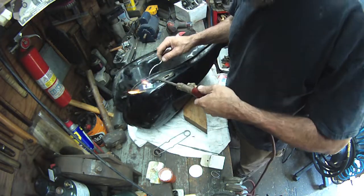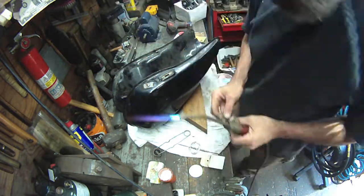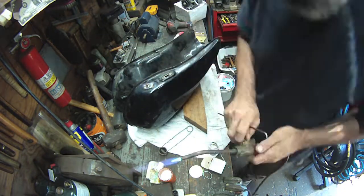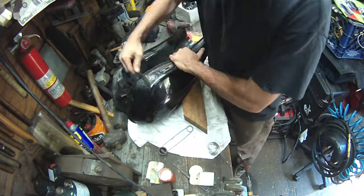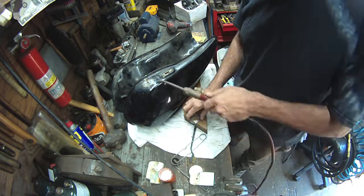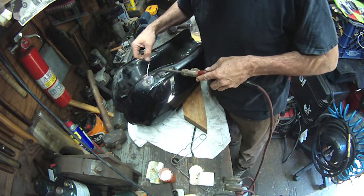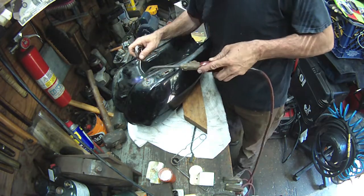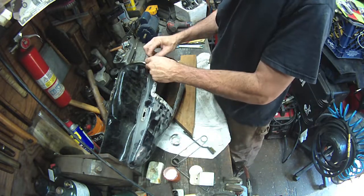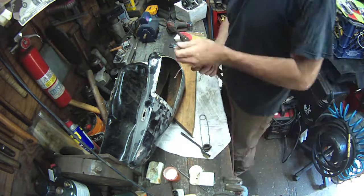It really doesn't take a lot of heat because it's a small quarter-inch barb fitting and it's thin sheet metal. I probably could have gotten away with using a propane torch, but the nice thing about this tiny little tip is that it's small and it focuses the heat right where I need it to be. The propane turbotorch tends to splatter the flame, and I just didn't want to create too much of an issue. This is funny because this is the bottom of the tank on a sawmill fuel tank that's going to be used in the middle of the mountains — I'm not taking it to sawmill shows — but here I am dressing the edge of the solder to make it look nice, even though once you paint it and put a tube on it and install it, you will never ever see your solder joint again.